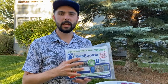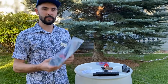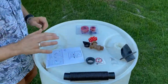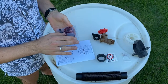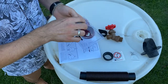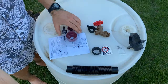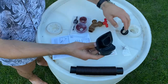We're going to be using this kit from Rain Barrel Depot and converting this Coca-Cola syrup drum - upcycling it into a rain barrel. This kit has everything that you need. It comes with a couple of drill bits - actually three - as well as a drill bit attachment. There are two sizes to drill into the rain barrel: the bigger one goes up top for the diverter tube, and the smaller one is drilled into the bottom for the spigot, along with a spigot gasket.